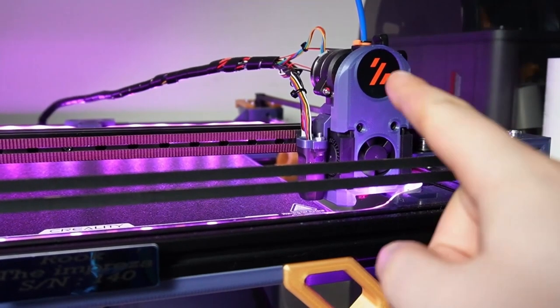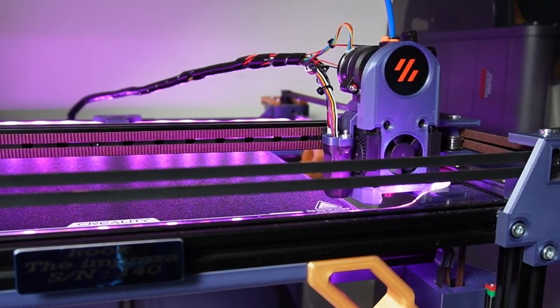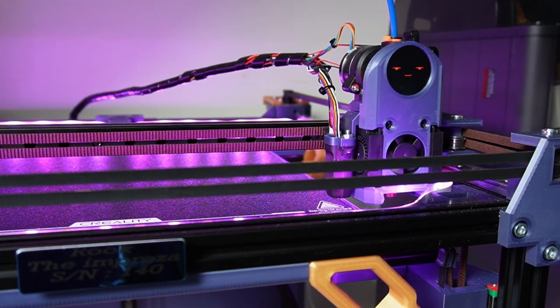Also, the extruder, when you print, the extruder would skip on a normal print, like with the values that we are giving in for the flow, it would be skipping and not printing. So we had to dial that in to 0.7 amps instead of the 0.5 it was on before the fix. So we have given it the max amps that you can give it under normal circumstances, because you can go up to 1.2 amps, that is the peak. So you cannot use the extruder motor on the peaks, because it will prematurely die. But 0.7 is still in the safe range, and that is what works for us.